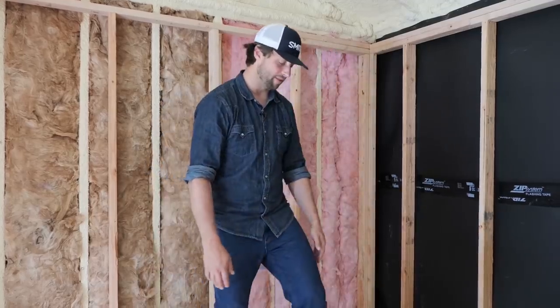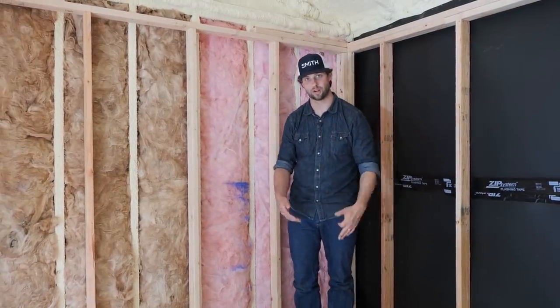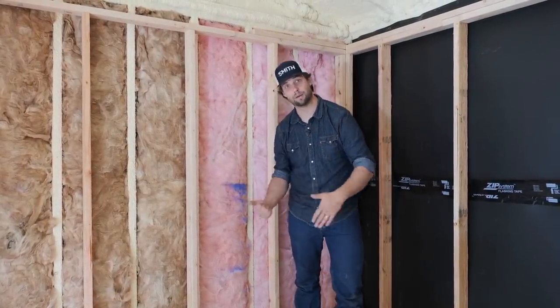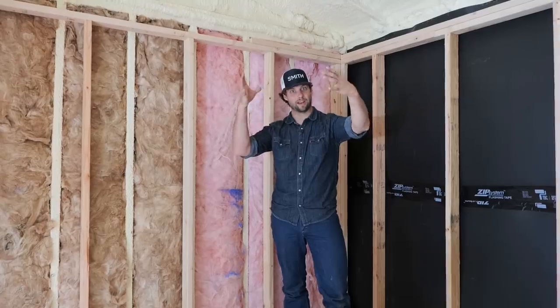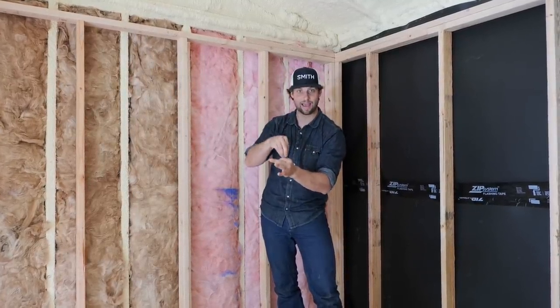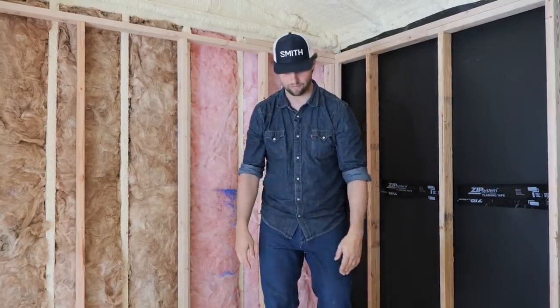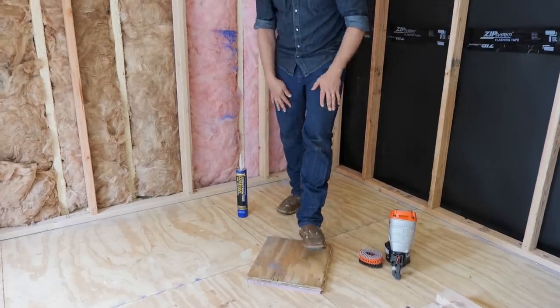I'm fine with this being a lower rating, but if I was doing this in a home I would probably go up on that rating just so I don't have to worry about long-term loading — especially if you're dragging heavy appliances or setting a pool table on it. The more weight you have coming down to a small point, all of that weight is applied at that small point. My big feet spread this out over the plywood, and it's not a problem.